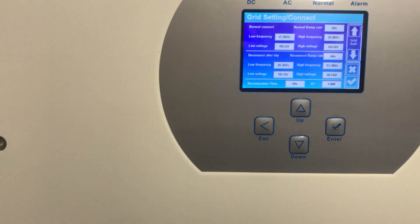Another thing you need to do is set up the gen port. Although the generator is rated for six kilowatts, I've set it to 2000 watts for now to see what that does. When you select 'gen connected to grid input', I think what it actually does is change your grid input tolerances to a much wider range — that's what that checkbox does.